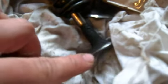They're a little bit fucked, let me say it like that. Just, there are my pistons here. So these are the old valves, like you see, like here. Let me just, here you see there was some blow by, so they were too tight. And I think this is the inlet one, or is it? I'm not exactly sure. It looks like the outlet one, but you see here it's very damaged, and so we really have to put new ones in. We could repair them, but nah, why repair such broken stuff when you get new ones for not that much money?